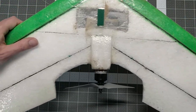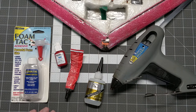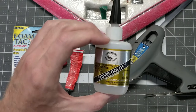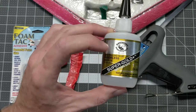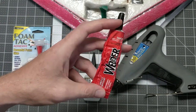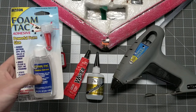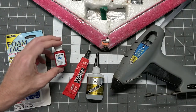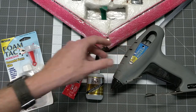When I built this kit, I only needed a few glues to bring the whole thing together. You could probably get by with less, but using the right glue at the right time really makes a difference. Combining different kinds of adhesives can really maximize your weight-saving potential. For CA glue, I made sure to use Foam Safe CA in the gap-filling medium-thickness style — it gives a better grip than the thinner stuff. I also used Welder adhesive, which is fantastic for gluing wing sections together. I used Foam Tack where I'd normally use Welder but go a bit lighter on application, since foam tack has some good flex to it. Thread lock is used for keeping the motor mount secured to the motor blocks, and hot glue works best for tacking in parts you want to be able to easily remove later.